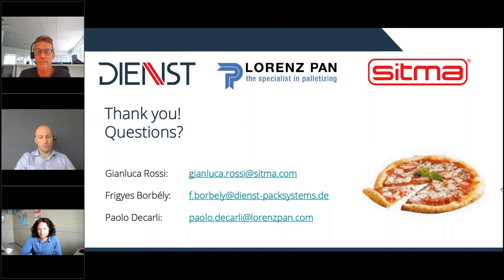The first question would be for Sitma. Can the machine handle irregular product thicknesses? Gianluca, can you say something about that? Yes, the machine is suitable for frozen food, and everybody knows the frozen pizza does not have a regular shape. So we realized the machine so that it can compensate for the irregularity in the shape of the product, especially in thickness. That's why we chose a solution with film reels coming from the top in order to compensate for this variance in thickness.